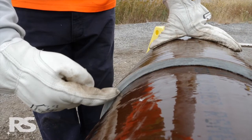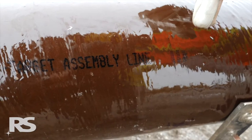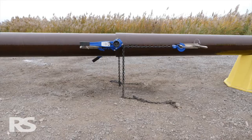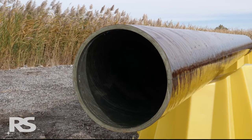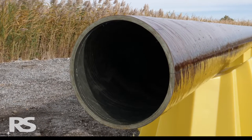95% of assembled slip joints will reach to within plus or minus 1 inch or 25 millimeters of the target assembly line as marked on the lower module. Due to the resin-rich surface of RS poles, there are subtle variations in the outside diameters of each module that cause the overlap to vary from slip joint to slip joint.